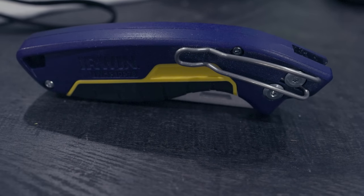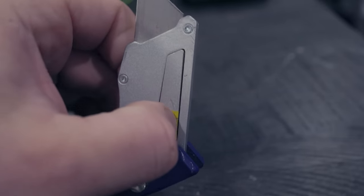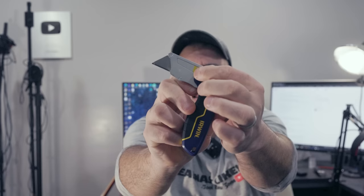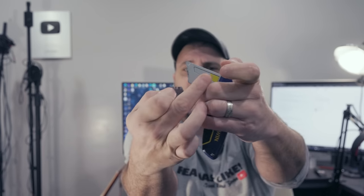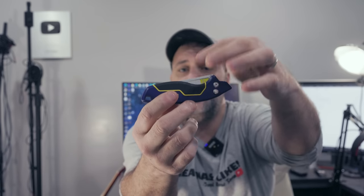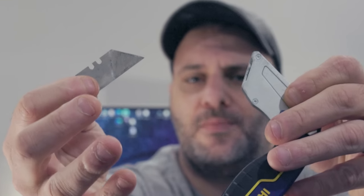That's just my opinion. Some people might like the Irwin. I will say the Irwin does seem to have a little bit more control, giving a better or more accurate cut when going down drywall tracing a line. Now the Irwin's release is a bit different from the Fastback's. With the blade out, you can't just pull it out — you've got to collapse it a little bit, push that in, and pop the blade out. It's a flat, secured type of release. This means you can't accidentally release the blade in your pocket, which I like — you have to extend it halfway, then push the release, then take your blade out.